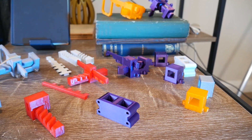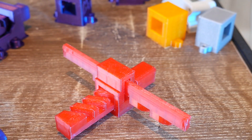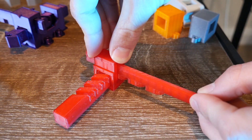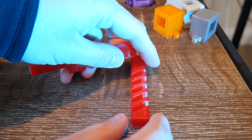But how can a gear be secure enough to act as a lock? Well I firmly believe in learning through experimenting, so I created this simple version in Fusion 360. In this design the key has a 30 degree attack angle and this results in a small gear reduction between the key's movement and the bolt. This design works pretty well but there's an obvious flaw — the tooth spacing is uniform, which doesn't seem very secure.